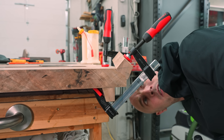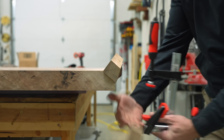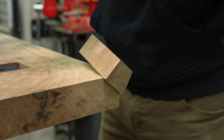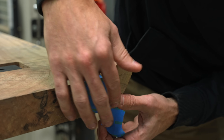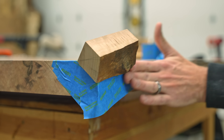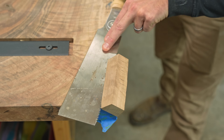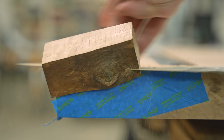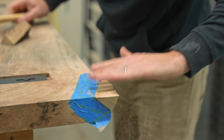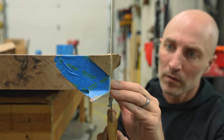I left this block awkwardly clamped overnight, came back the next day, removed the clamps, and now I was going to trim it up without hurting the slab. Flush cut saws — ryobas — are supposed to not scrape the wood, but they always do, so I'm using some painter's tape to protect the wood as I go through the cutting process. This ryoba is a relatively cheap one I got at Woodcraft, but it does do the job.